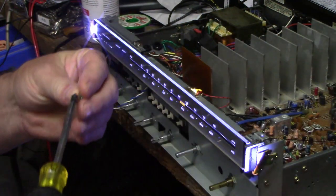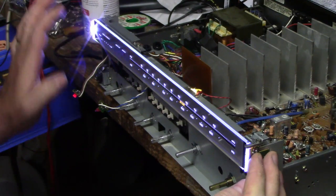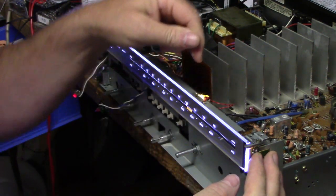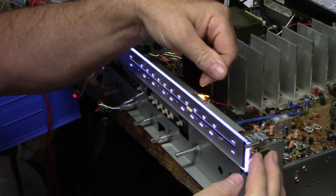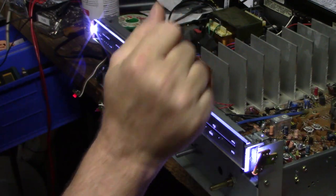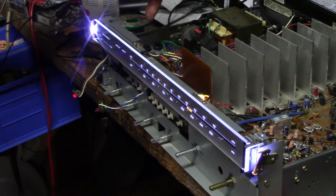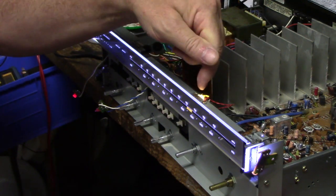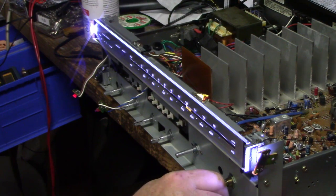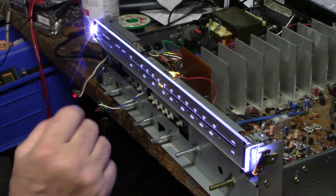It does have a cool white light. I also have a warm white LED in here — I replaced a little incandescent that was in the hole, which I think was original because the glue was all intact holding it in. I replaced that incandescent with a warm white LED going back to the same 19 volt supply through a 3.3k ohm resistor to drop the current down to about 4 or 5 milliamps. This one will stay cold as well. There's no strobing — it should last indefinitely.